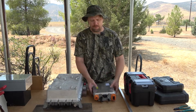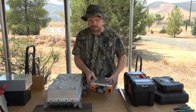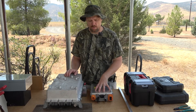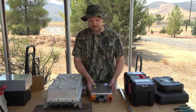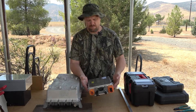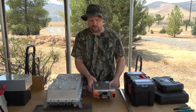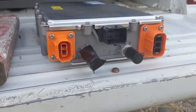What I'm replacing it with is a Valeo Siemens — it's currently not in stock anymore. I actually wanted an Elcon initially, but this one is a CAN bus-controlled charger. It's liquid-cooled. These are the same power level, and it gives you an idea of the significant improvement in charging, power, design, and circuitry over the years. This one can accept both 120-volt and 240-volt, and because it's liquid-cooled, it's a lot smaller and more compact.